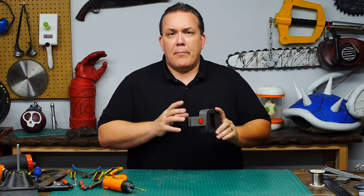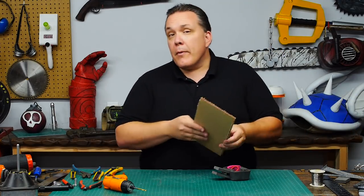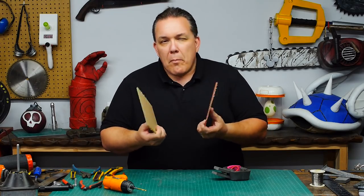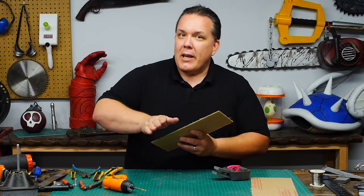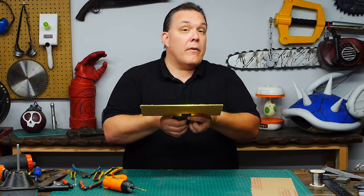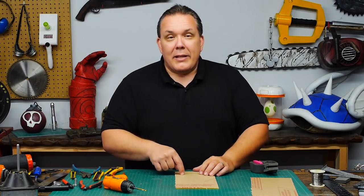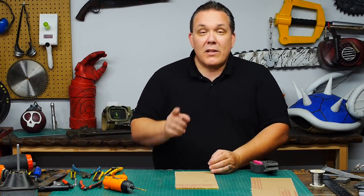I have the majority of components for the main body, but I really need the scope that comes around the eye. The easiest thing would be to cut a piece of plastic, but I want to use a particular type — cast acrylic. Each sheet has a fluorescent dye in it, making one fluorescent green and one fluorescent orange. They don't make a blue one with this property. What this does is refract all the light that hits the sides so it comes out the cut edge, making the plastic look like it's glowing. Once this is put up against the LEDs and activated, the whole thing will light up. Additionally, I can use a Dremel to engrave a heads-up display onto it, so when you look into it you'd actually see the marks in front of your eye as if you're getting your power reading.